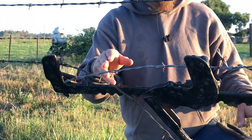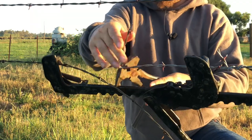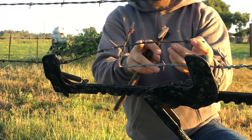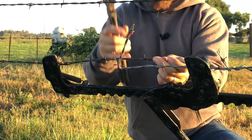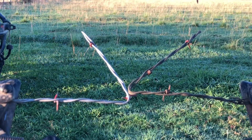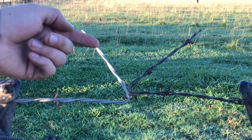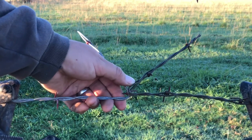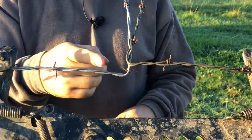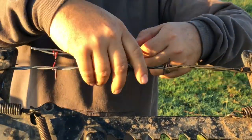When I'm making this last splice in the middle, I do what I did on the first one — I'll go in here about five or six inches and bend that up on a 90-degree angle. Then rather than doing the five or six inches on the other side, you want your bends to kind of line up with each other. I wanted to give you a better look at how these two bends line up, because this will be really important for how tight your splice is. After you make your two bends in the wire, you want them to just butt up to each other or just barely overlap — that's going to be perfect. Now that we have these two bends in basically the right spot, we can go ahead and hook these wires together.